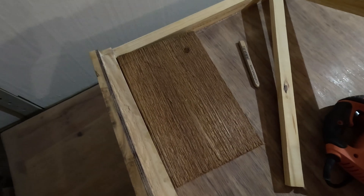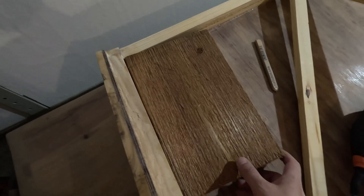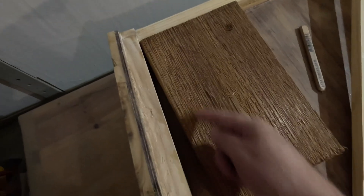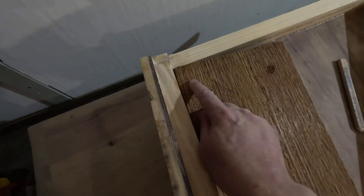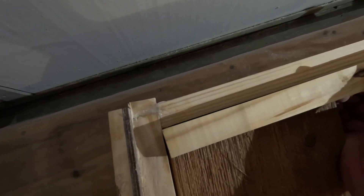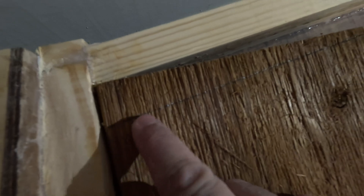For this bow support piece I cut off a one foot piece of the two by eight of western red cedar. I thought about how to place it — I could have placed it up flush with the front board and then tried to trim it off. Instead, I put it up against this corner and then trim this off. To mark this line I put a board here and got that edge as close as I can, then take the pencil and mark the line.